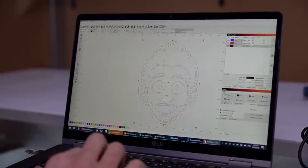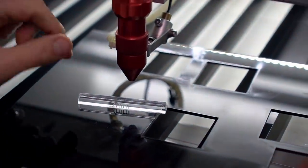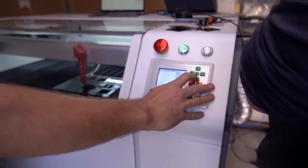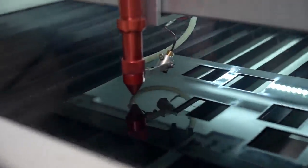My laser is ready, then I send it. Seven millimeter focal distance facing towards me, the operator. I can raise and lower my table, come up close enough, set my height, and position my sheet where I want it to sit. So you tell it where to start. Turn on the fan. That works.